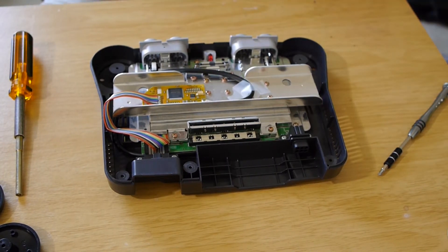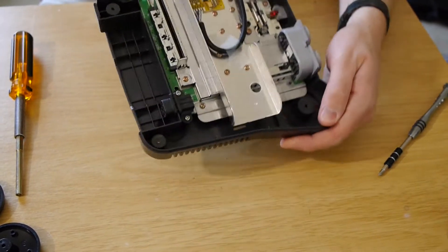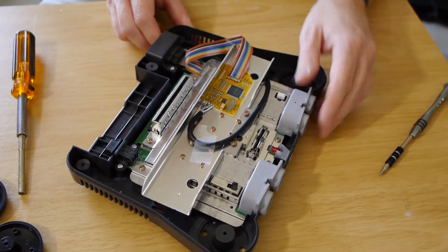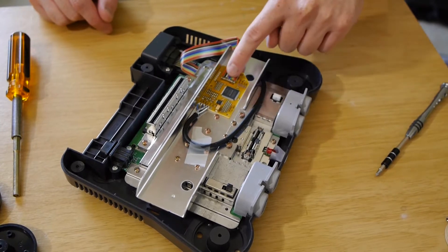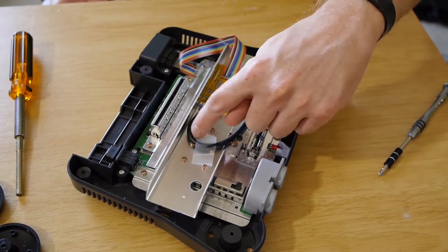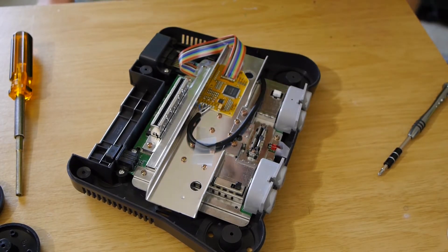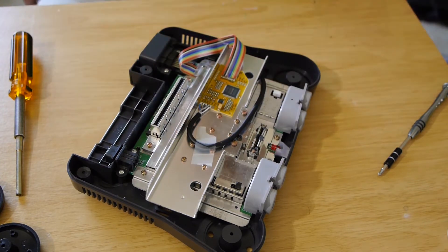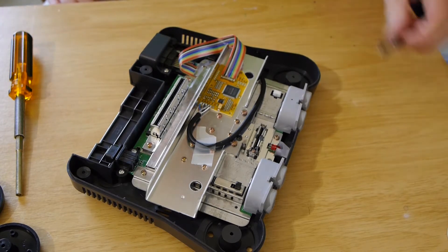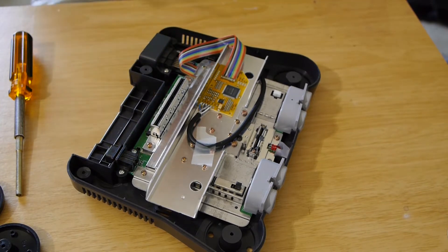You'll see on my installation I did it a little bit different here. This is not a normal wire that comes with it. So here's our N64 RGB board. This is the wire that comes with it, and this is actually a bit of Mogami microphone wire that I happen to have sitting around. What we need to do now is take off this whole heat shield assembly, so for that we're just going to use a regular old Phillips screwdriver.